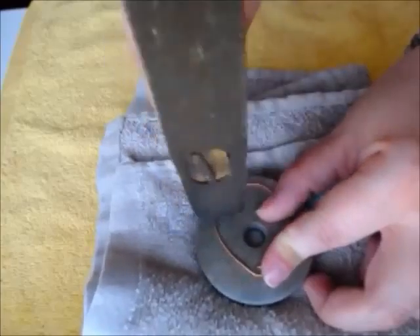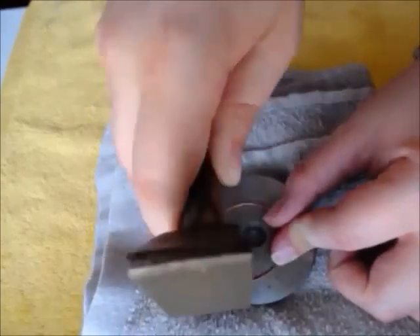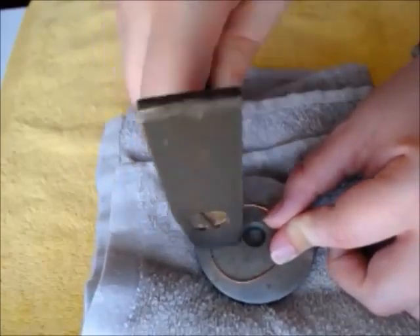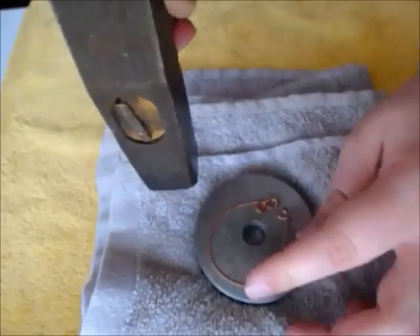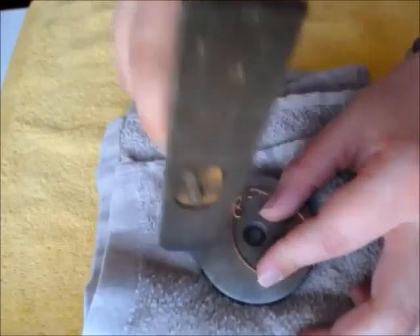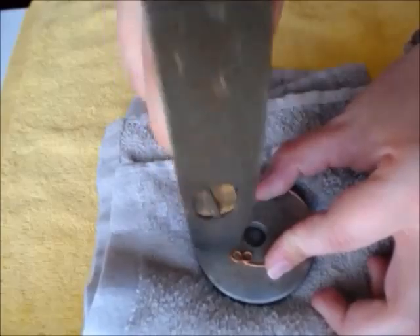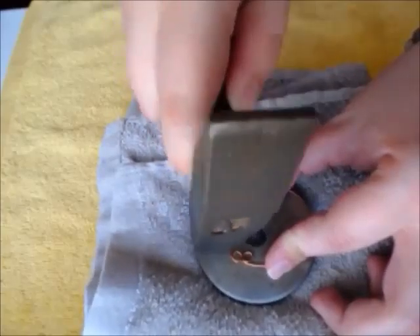This wire is 0.75 — it's rather soft, and there is no need to scratch or crash it by beating with lots of power. If you put too much power into your actions, you will damage the wire seriously and it will have ribs and scratches which will not be possible to polish.